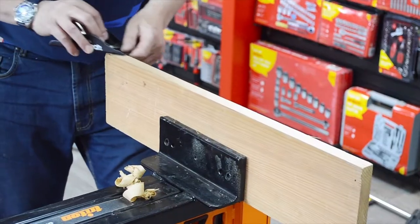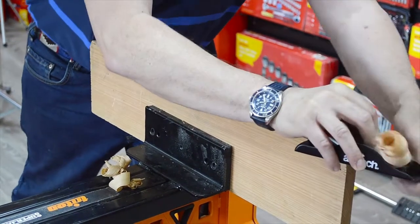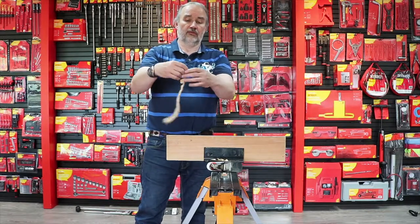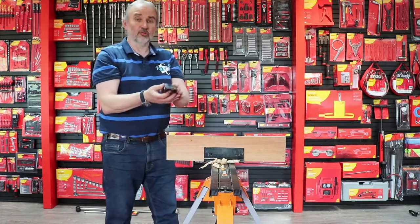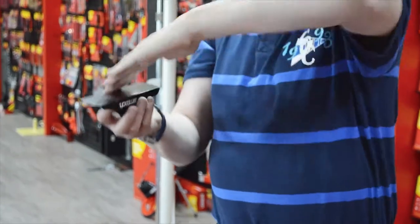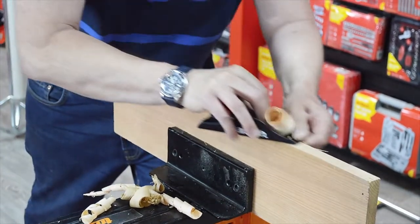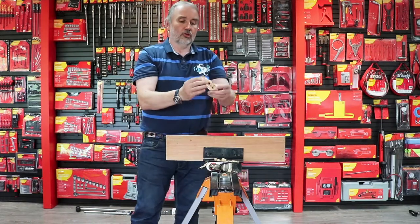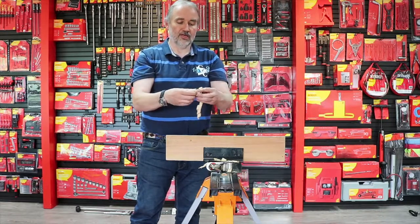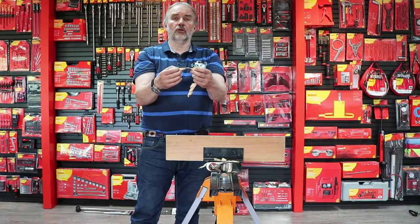Now if I try it and see — that's not bad for the first go! With those simple settings I've managed to take off a lovely even shaving. Set up right, about half a millimetre maximum sticking out and parallel — not at an angle — and you get a good shaving: long, not broken into bits. I can untangle it and get a lovely thin layer of wood come off. I hope that helps. If not, go to amtechdiy.com and we look forward to answering your questions.